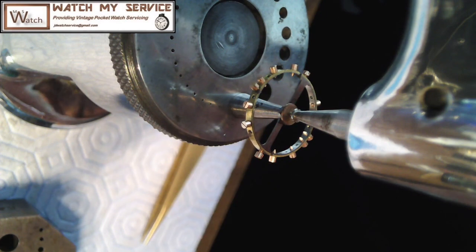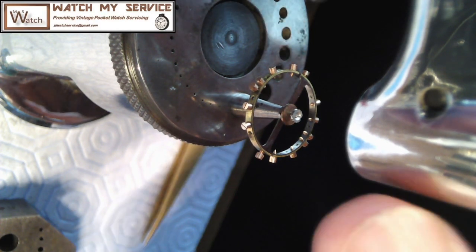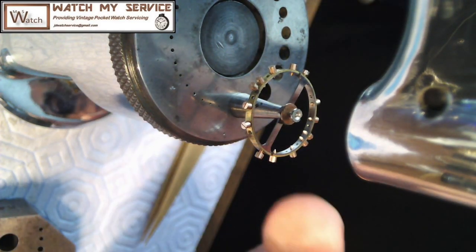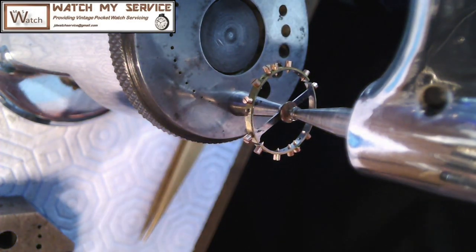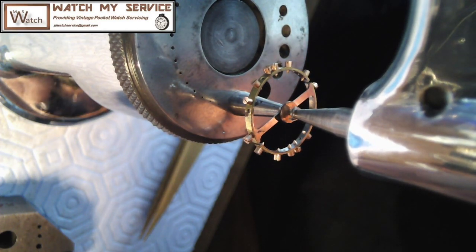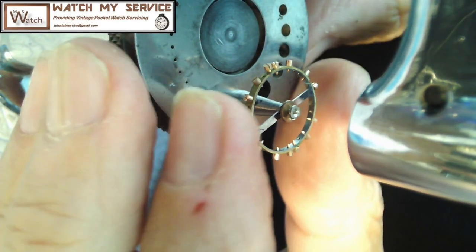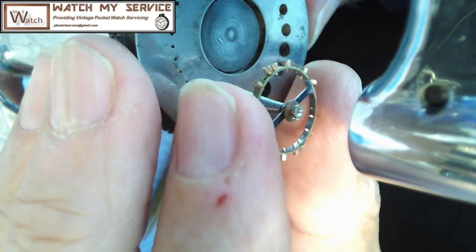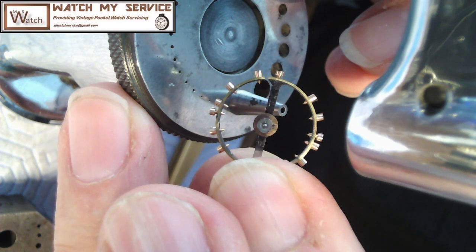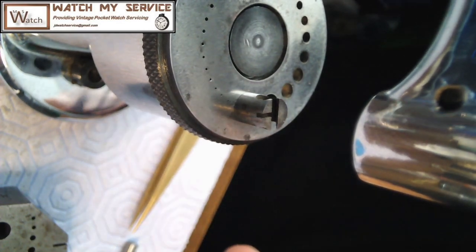You can see I'm wearing my Saint Martin watch - a quick watch check there. Anyway, that's staked down. This is one of the few times I'm actually narrating rather than just talking while doing the work, but this work was such precision work it took me a long time to get it done right. Putting on the parts of the balance was not the hard part - it was actually finalizing the whole thing. It's being staked on now and you can see there's enough of the balance showing out, so that part is now good to go. Now all I have to do is install the hairspring and we're good as gold.